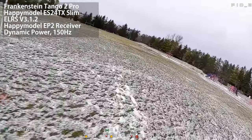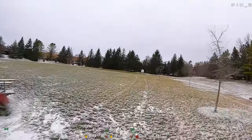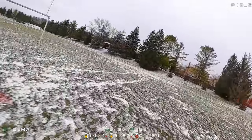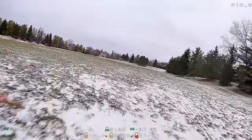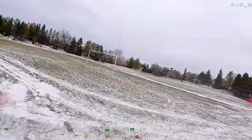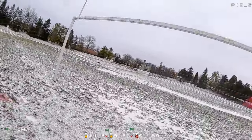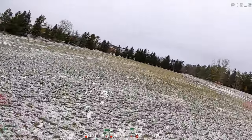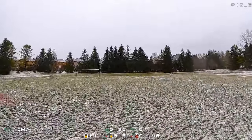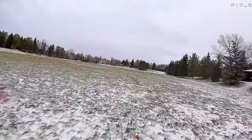Next test: the same setup except at 150 hertz versus 250. We see a little bit better link quality here because there's more sensitivity at lower hertz frequencies. Coming around the same spot, we are now on 10 milliwatts — not being forced into 250 like the prior test. At 150 hertz the receiver is performing better, sticking to 10 milliwatts with link quality in the low to mid 90s. Perfectly fine and perfectly flyable.